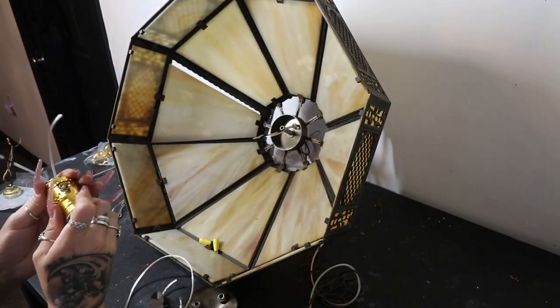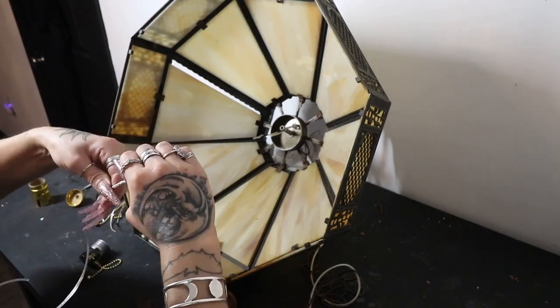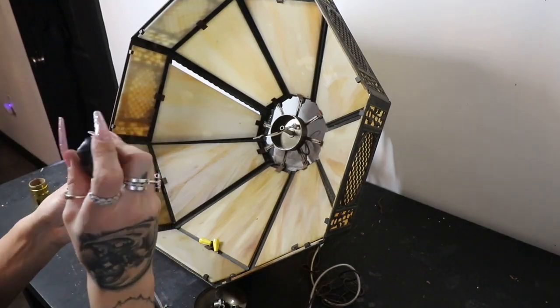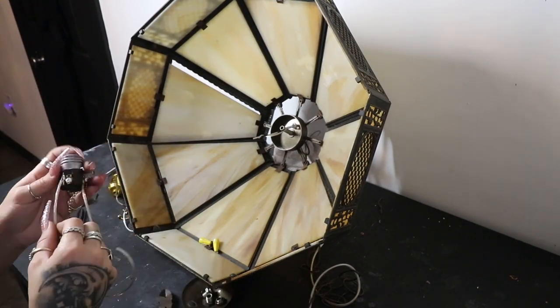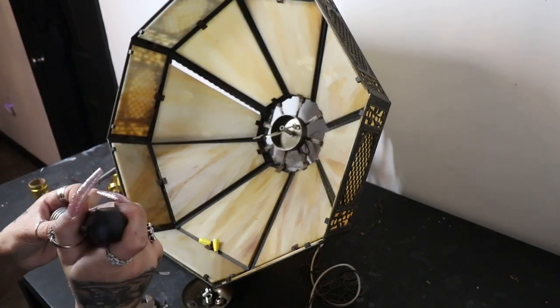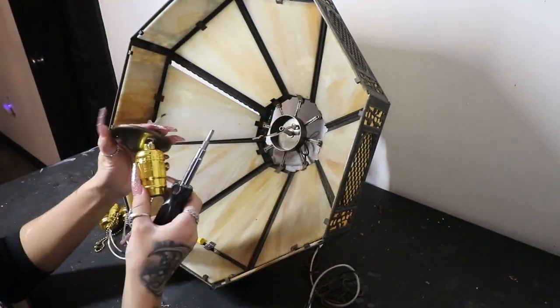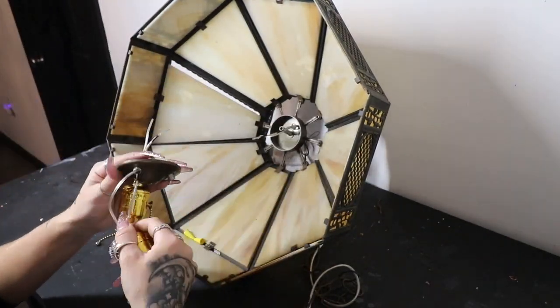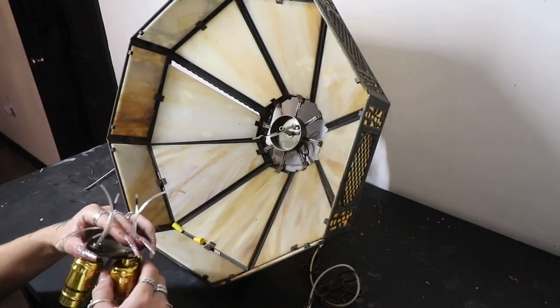So we take our new six-inch wires, strip about a half inch off the end, wrap around those screws, and tighten it. We're going to mark these wires so we know which side is black and which side is white, because we won't be able to see the screws once we put that cover back on. Once we've got all of them replaced, we're going to take all three fixtures, look for all three black wires from each of the three fixtures, and connect those together. Then we take the three fixtures, grab each of the whites, connect them together. So now we've got three fixtures with six wires — three black, three white — all attached in two groups of three. Now we're going to take those groups of three and attach them to that mainline wire.